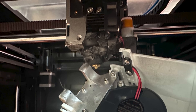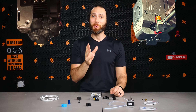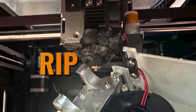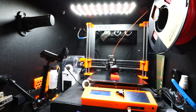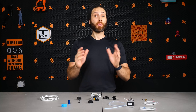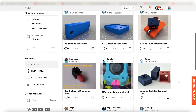Silicone socks. Before we move on from the plastic ball monster threat, I do want to mention that silicone socks, as far as I'm concerned, are consumables. They can be damaged by the aforementioned plastic ball monster, or given the heat they're subjected to every single time you print, the simple act of removing and reinstalling them when you go to replace nozzles can also tear them. On some printers a silicone sock is less necessary than on others, depending on how the heatbreak fan is positioned, but it's still a very good idea to keep some on hand for each of your printers. Fortunately, unlike most items on this list, you can actually print a mold for a silicone sock and cast your own version if you have high-temp silicone on hand, though I usually only do that in a real pinch if I get caught without a professionally manufactured replacement.